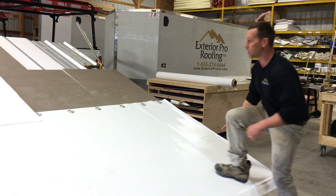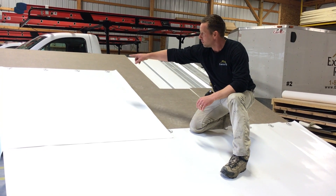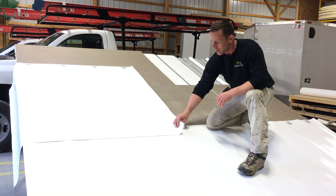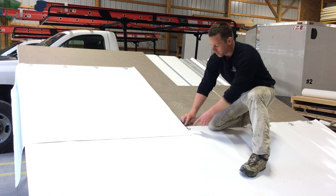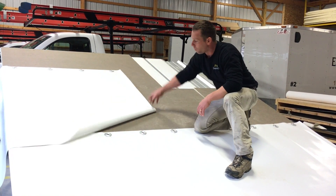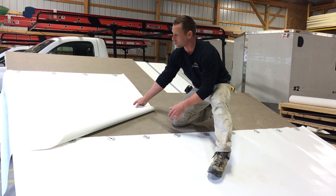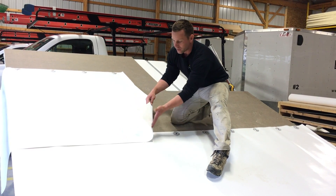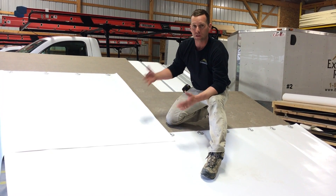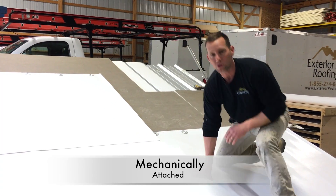When it comes time to add my next sheet — you can see up here I've got one partially laid out — I've already got this sheet screwed down, so I would have another line of fasteners. I left myself a six-inch overlap to make a seam, and that seam is going to be made with a hot air welder. There's no glue in this method — it's all screwed down, and then this sheet is going to weld to the next sheet where the screws and plates are.